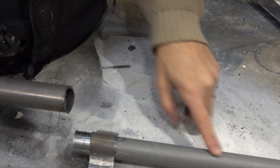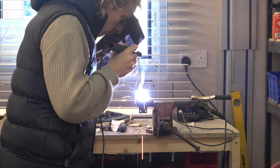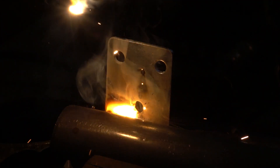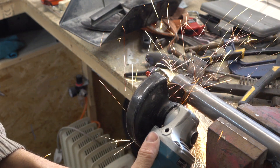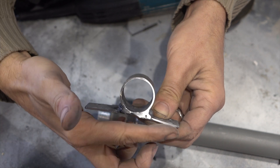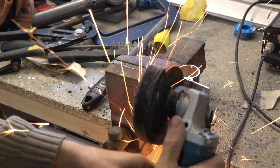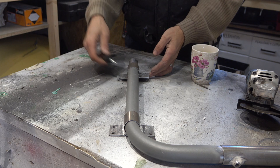The way I've made this, I've used a bit of tube that's just big enough in diameter to slide over there — it's a perfect size, in fact it's a little bit tight. First thing, we've got to weld that to that. I'll put a cut through there, spread those a little bit, and that should make it nice and loose for getting over the pole. There we go — all we need now is to weld a nut on there so we can tighten our table up. There we go, let's get it painted.